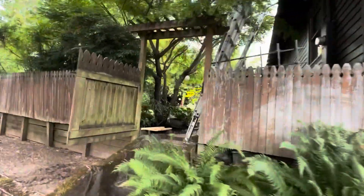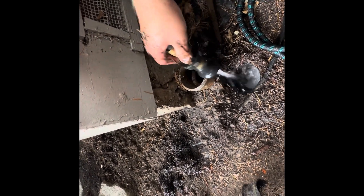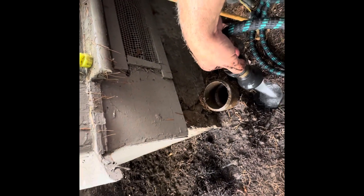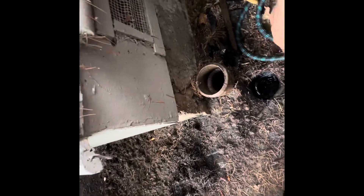I pulled some of the debris out from this drain pipe. This one does work — we're putting water in here, and when we turn it off the water does disappear, so it is going down. I'm guessing it goes out into the yard — some sort of French drain. It's probably okay, but in a heavy rain it might overflow. It was clogged towards the top, but it's not too bad so I think we can use it.